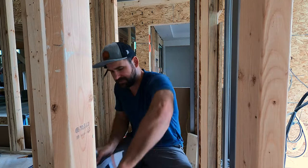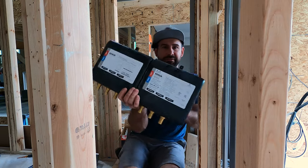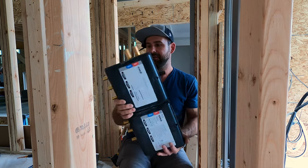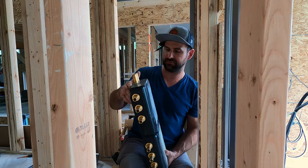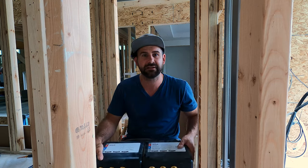The valve we're going to be installing is this electronic Kohler valve. It's got six ports coming out the side of it. We're only going to use five — we'll block off the sixth. Out the bottom are our water inlets: hot and cold inlet, and then mixed water coming out of it, which is why you only see six ports and not twelve.